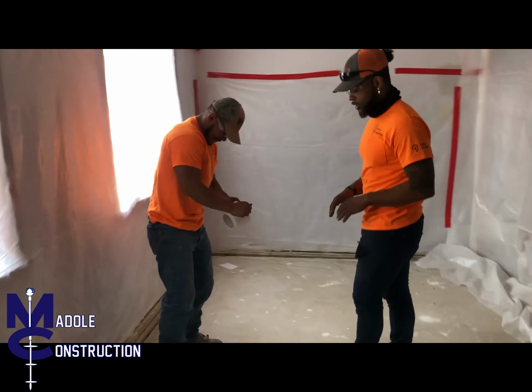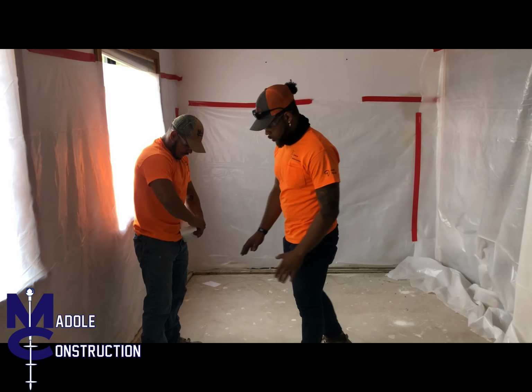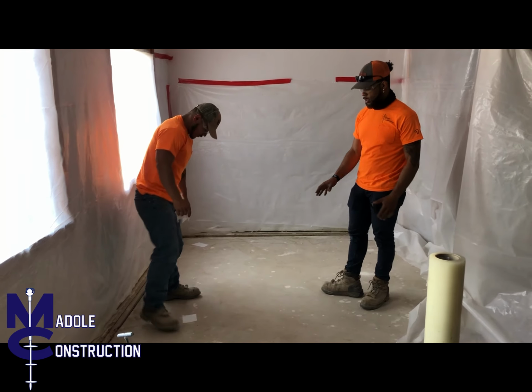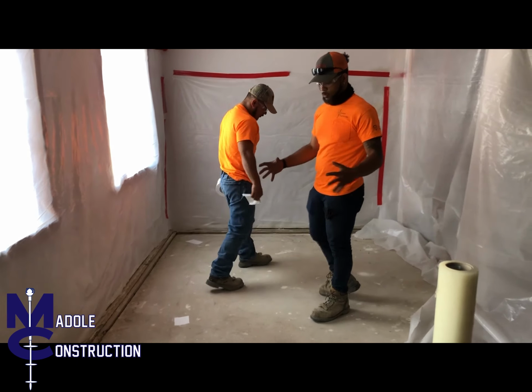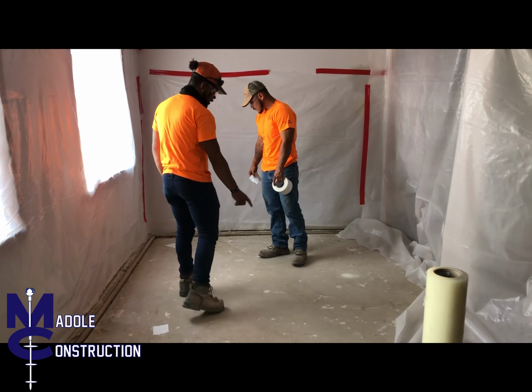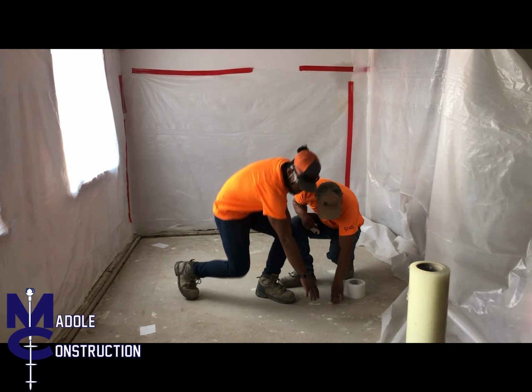Foam spreads a maximum of 6 feet underground, so we'd like to grid out our spots where we're gonna drill, and they're gonna be approximately 3 to 6 feet apart from each other so that the foam has room to work inside the voids. And then we're probably just gonna do it right here. Actually, look for the net. Put that right here.